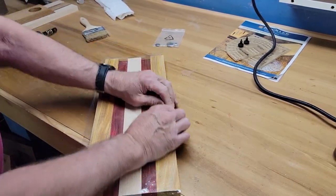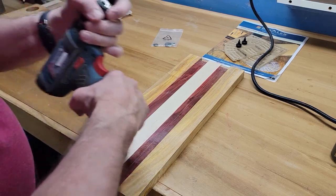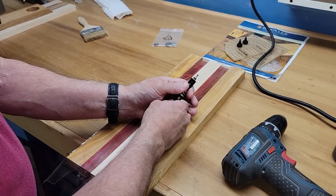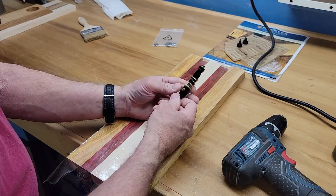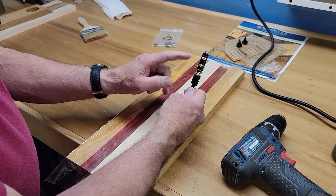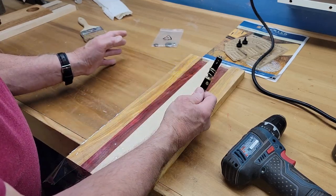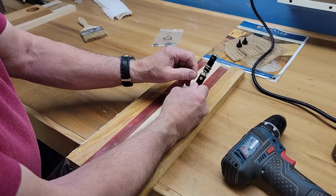It's still going to need sanding once you have all your holes drilled. What I've done is taken the drill bit that comes with the kit out and put in a Brad Point bit. These are 1/8-inch bits that I bought on Amazon - I'll put a link below for that. I'll make a recommendation: before you take this apart, before you loosen that Allen set screw, take a picture of this, because you're going to end up with pieces all over the workbench. Don't ask me how I know that. So take a picture so you can get everything back in the proper orientation.